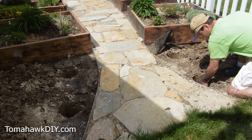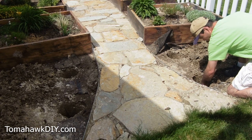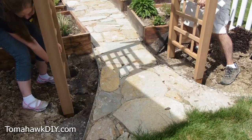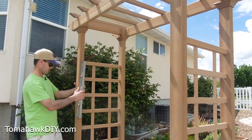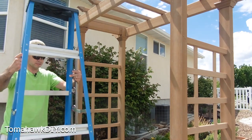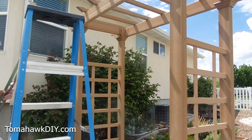Try and flatten that soil out a little bit before we put a post in, tamping it down just with the board. Okay, let's try putting this back in. Checking the level — I think we're starting to get pretty close. I'm going to grab a ladder and check up on the top here too. All right, I think we've got it.